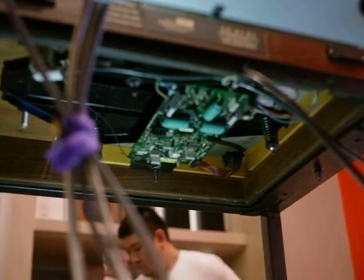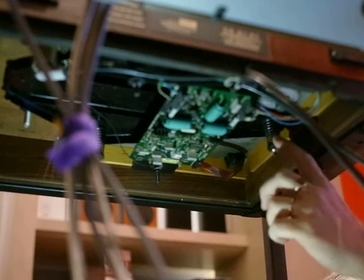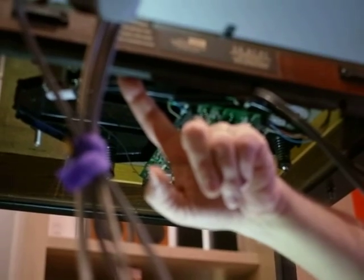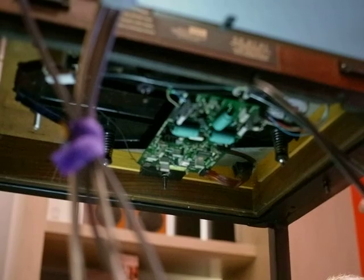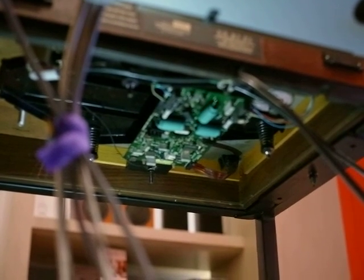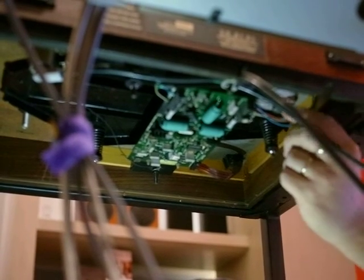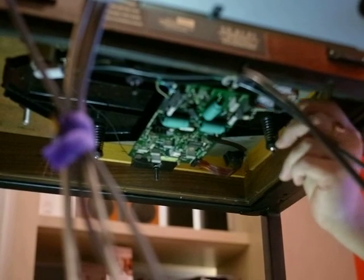Remember I said this suspension system is a filter. If you join the cable straight to the plinth, there's no filter. So all the noise from the motor, from air movement in the plinth, travels straight from those cables, straight into your tone arm, straight into your cartridge. And I know because I've tried it myself. Because it seems like a logical thing to do, until you understand how the turntable functions, and then you realise it's just completely the wrong thing to do.